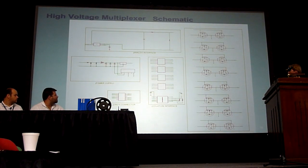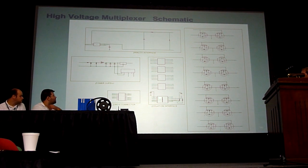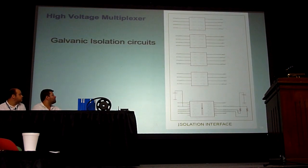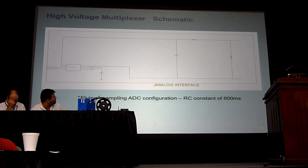This is what the whole circuit looks like for this high-voltage board. Here are all the MOSFETs — we're basically just selecting two that are connected to one segment of the battery pack. Then you shut those off, connect the next two, shut those off, connect the next two. Those interface into the ADC, which is read by an I2C isolation chip that sends that data out to the BMS board. And this is a close-up of what those bidirectional MOSFETs look like — they're just driven by a digital input that comes from that isolation chip. Then this is what the isolation chip is set up for in the I2C isolation. The sampling capacitor takes about 600 milliseconds for this circuit to charge up, and then the ADC can be ready for the voltage.